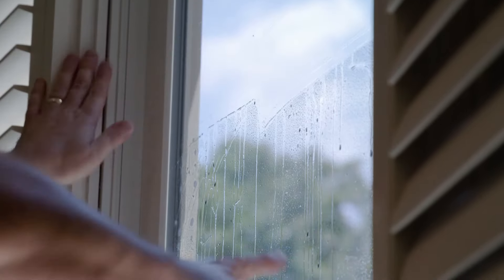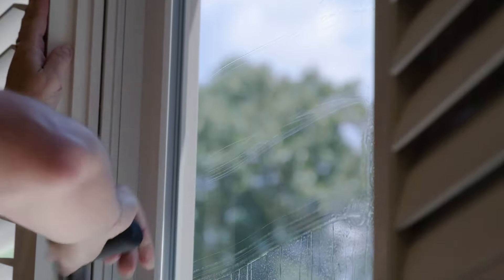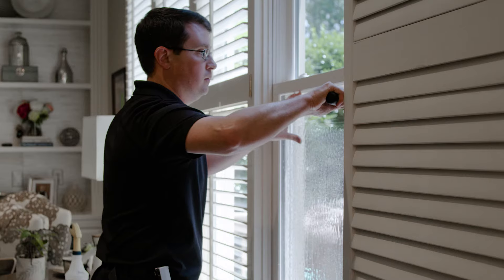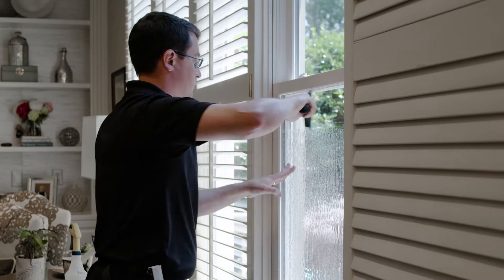When the seal blows out, it lets in moisture. Or it can overheat the glass to the point where it actually cracks or shatters the glass. So if you're doing a film installation, you want someone who understands these factors and can give you the right film for the right job.